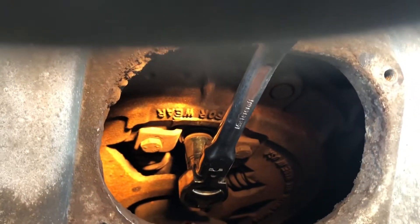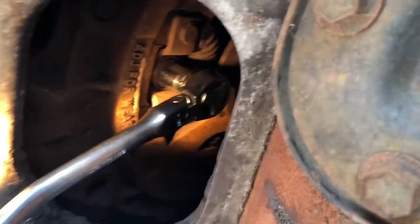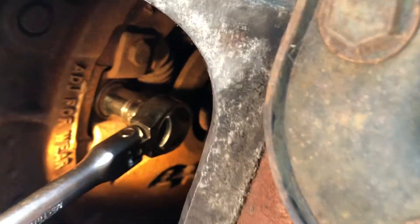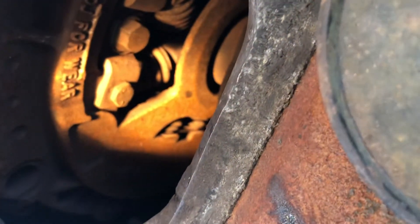Hope that makes sense to you, but I'm going to have to shut the thing off because I can't push this. Let's see. No, I can't. I'm going to have to push and turn. All right, I got to push it in and it's easy to turn. So that's a quarter turn, half, three quarters, and one. Now you got to make sure that that adjusting bolt pops back out, because if it doesn't, you're going to lose your adjustment because it stops the inner plate from turning.